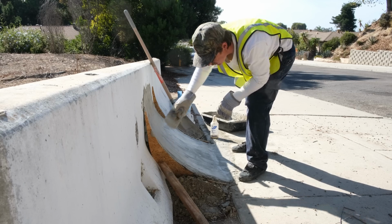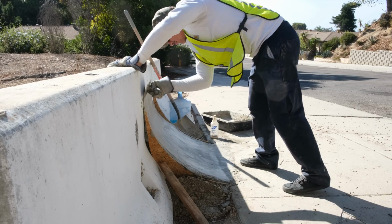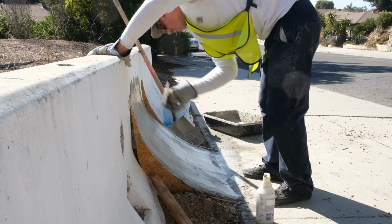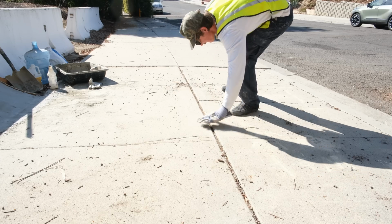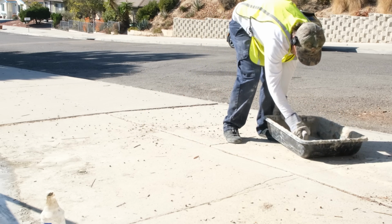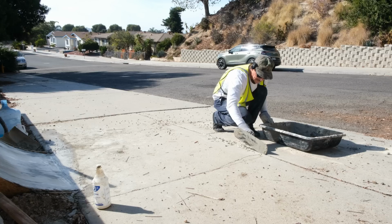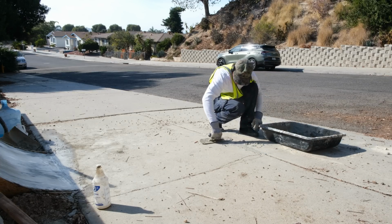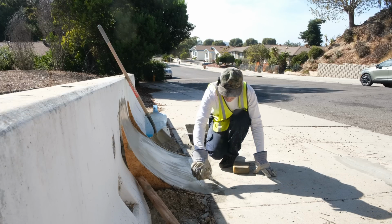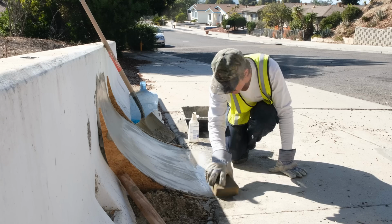I also do want to pull these forms in a second, just to make sure everything looks good underneath. See if I can fix some of this crack. I might as well, since I have a little bit of Cemental, just get it right into place. Obviously I can just Bondo this. Kind of sponge it. As you can probably see by now, this stuff's getting dry pretty fast, so I'm gonna hit this bottom seam.